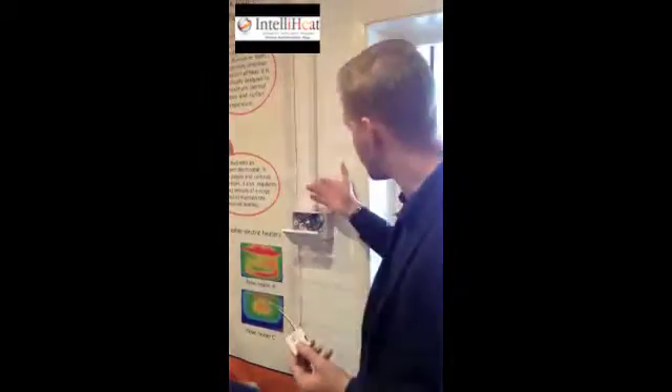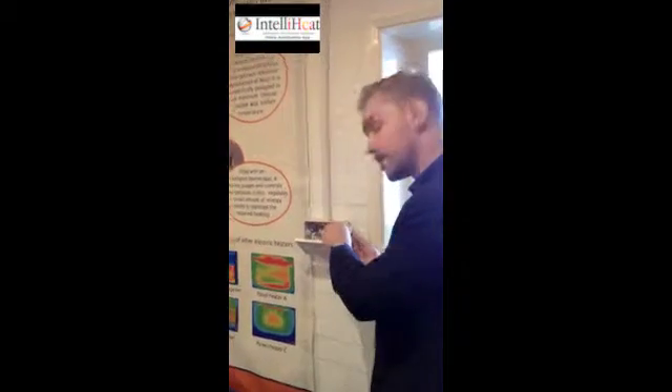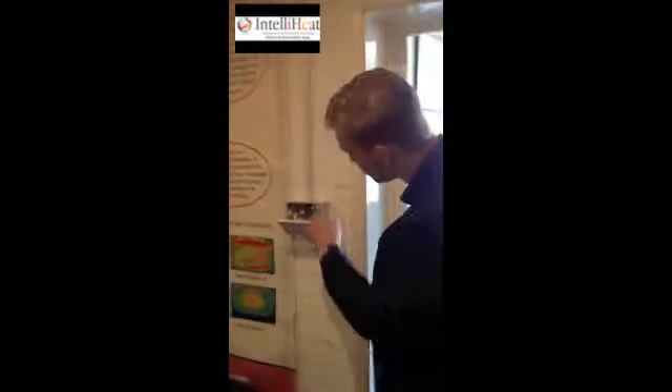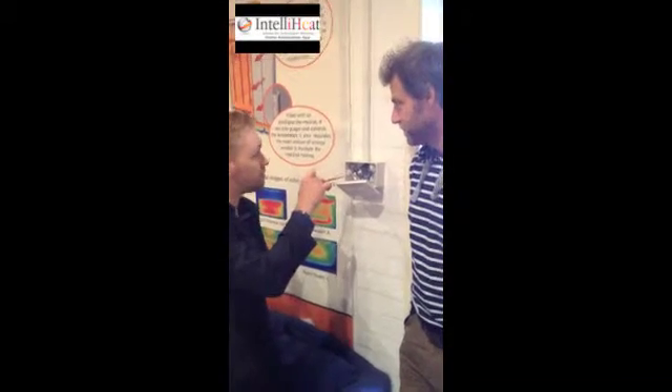This here is a transmitter, and what this will allow you to do is create a two-way lighting system instead of running cables chasing up and around to another lighting point. All you do is sync another back box, wire that directly to the switch — it comes with a battery — and stick it inside the back box to control it on and off. In your existing back box you'll need to put one of these, either in the back box or in the ceiling rose. We've just installed the receiver, so now we're going to get it to associate to the phone.